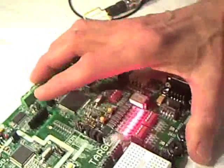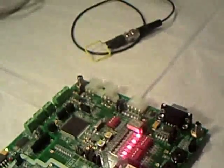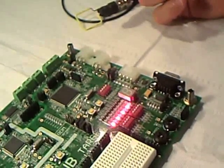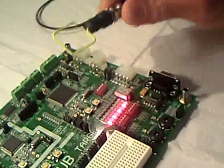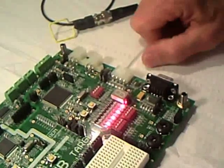This board is sensitive to ESD. If I do an ESD event up in the air a foot or two above this board, it will radiate down and reset the board, just as I did. The trouble normally with finding a problem like that is: where do I start? And this method gives you a starting point — it narrows down where you need to look.